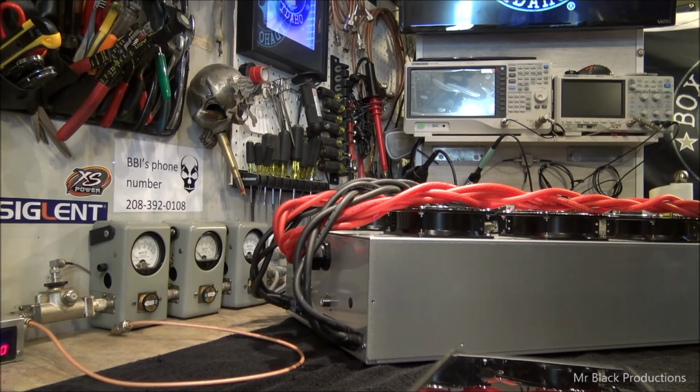In our secondary taps, of course, we're going to need a 0, a 3500. Oh, shit, where's my notes? See, I'm not even prepared. Okay. 0, 3500, 4200, and 5600. And we're going to need that at 3.5 amps on the top tap, and it's going to be intermediate duty. Okay, 5600, 4200, and 3500. How many amps? 3.5, sir. 3.5, okay.